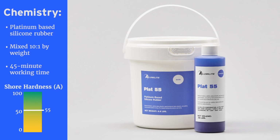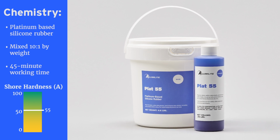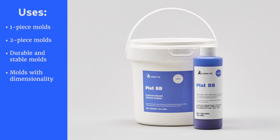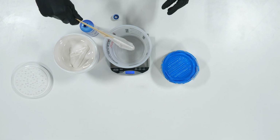Plat 55 is a platinum-based silicone rubber mixed 10-to-1 by weight. With a 45-minute work time and a shore hardness of 55, it's great for two-piece molds that require great stability, dimensionality, and durability. After creating your mold box, weigh out the base amount that you need.